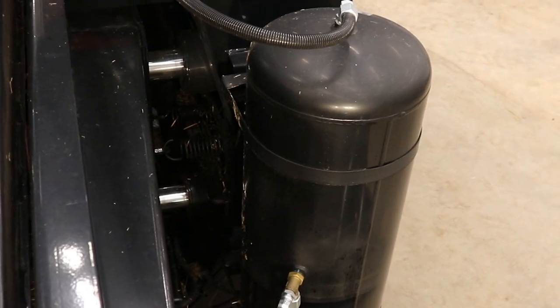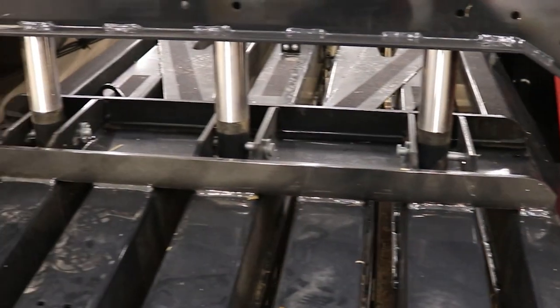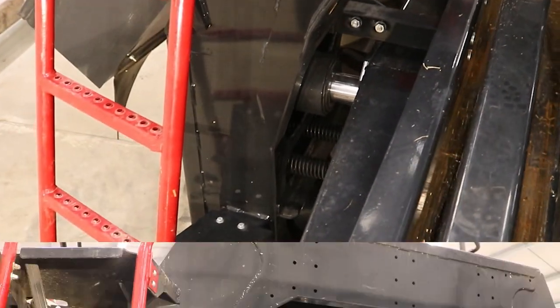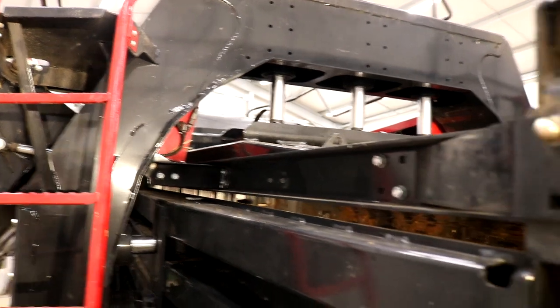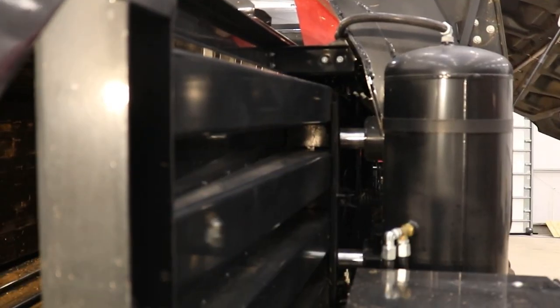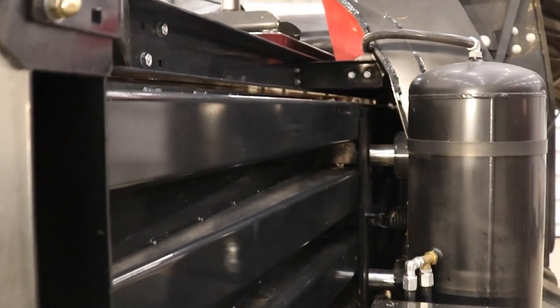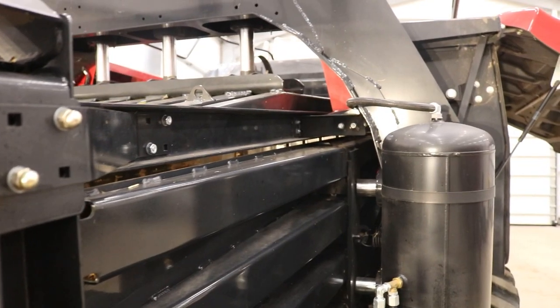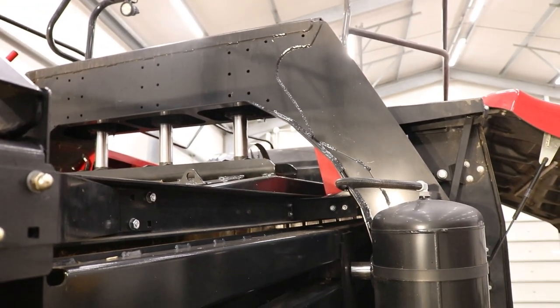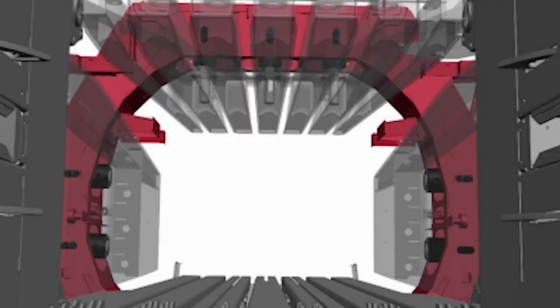The all new LB436 HD baler comes with a new three-way density control solid steel ring mounting seven double acting hydraulic cylinders — three on the top and two on each side. The double acting rams act on the chamber side walls and ceiling to ensure an even load is applied to the bale for maximum density and excellent bale shape, essential for good stacking and good transport.